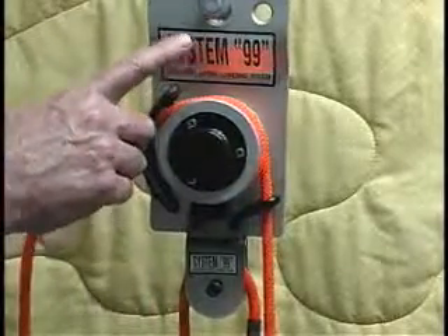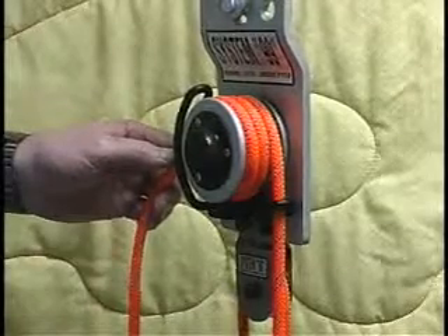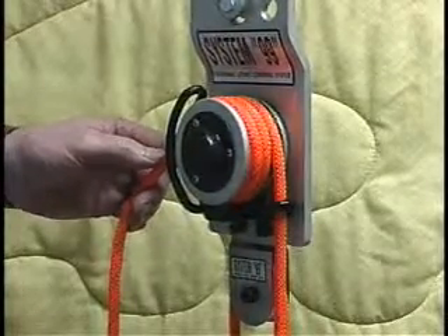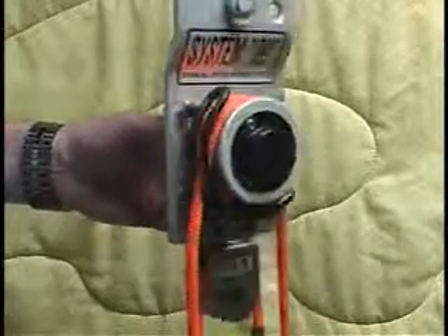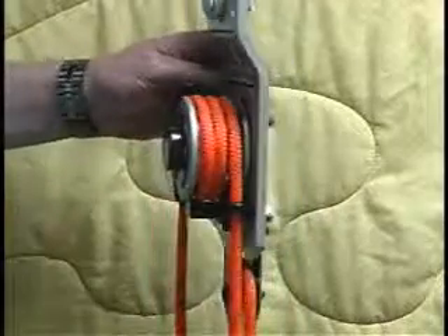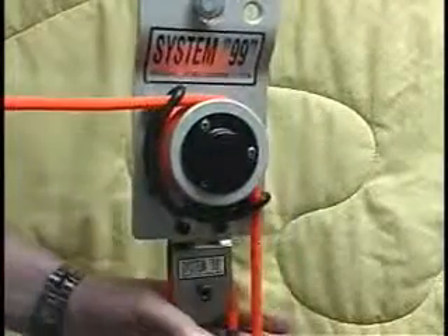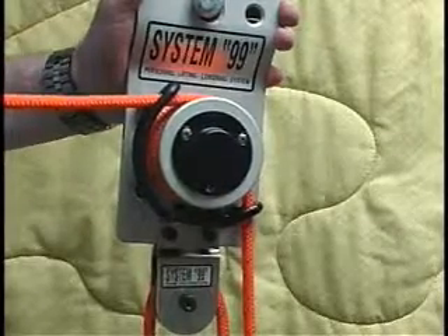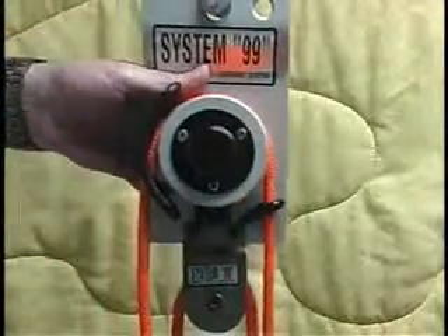The brake, of course, is brought about because of the one-way action of the drum. As I mentioned before, the Navy at times refers to this system as a handy billy. We can put virtually any rope length on these systems — we sent a couple out recently with 2,600 feet of rope on each, that's like a half a mile. Because we're set up here 3 to 1, when you want to lift a 180-pound load, you've got a pull force of 60 pounds, which is one-third. The 3 to 1 comes from the three load-side ropes and the one free side — that's where the name comes in. You're lifting a third of the weight, and it's hanging in the system.